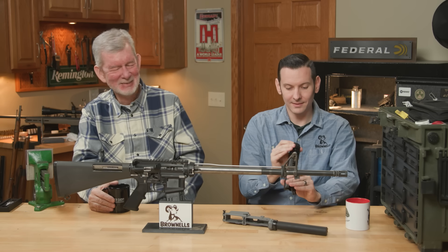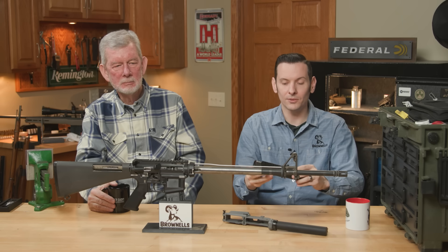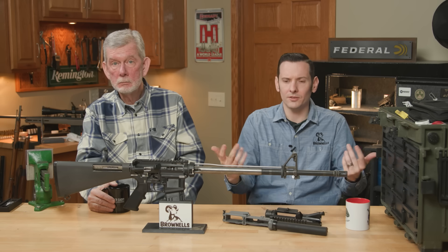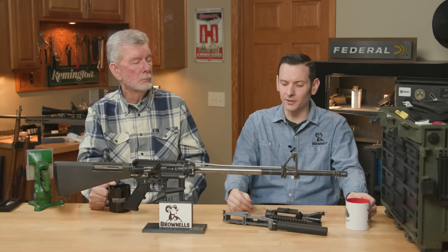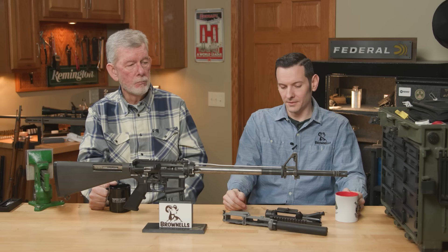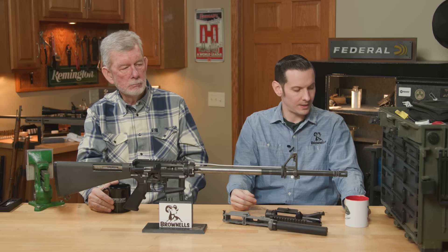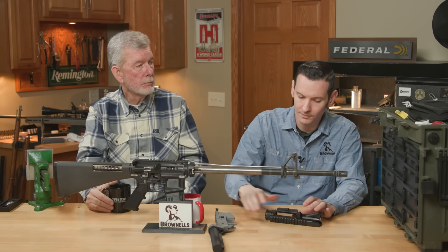Just keep your teeth straight. You don't need dental work to get this to work. All you need to do is torque it to the right setting. Worst case scenario, let's say you go through the torque ranges and you still can't get it — use a shim. There are barrel nut shims out there, and those work just fine. Despite what you may have heard or read on the worldwide interwebs, those aren't going to hurt anything. The odds against that happening are really, really small. The factories assemble thousands and thousands of these just first time with the barrel nut — no shims, no nothing. Colt cranks them out like crazy for the military contracts. Never saw a shim in a Smith and Wesson, a Colt, an M&P 15, or a SIG.